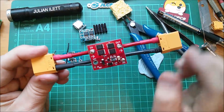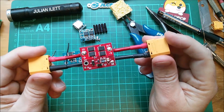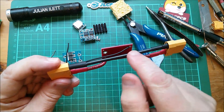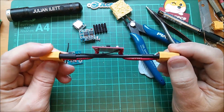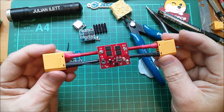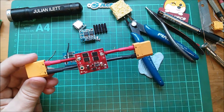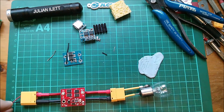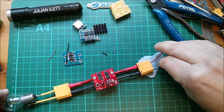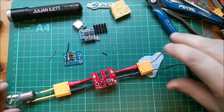That's my finished module — an in socket and an out socket. There's the thin black wire running up to the ground point, and the thick black wire runs right across. So that's my ideal diode — solar panel goes in there and this will go to my 24-volt lithium iron phosphate battery. Doing the bulb and battery test: it lights up going one way, as the arrows indicate, and the other way it does not light up at all.